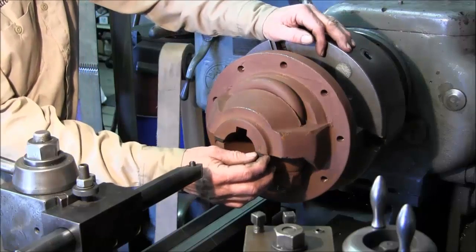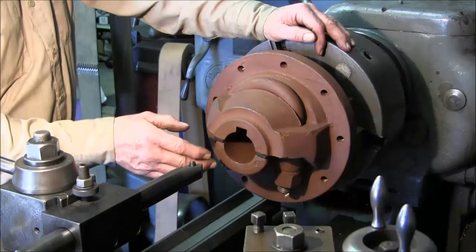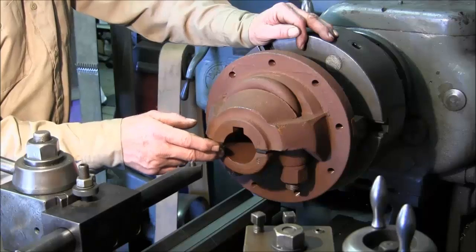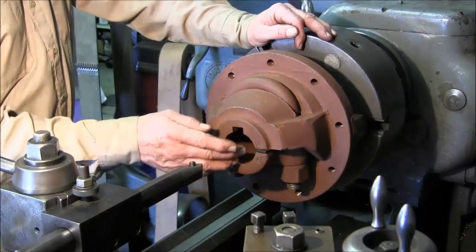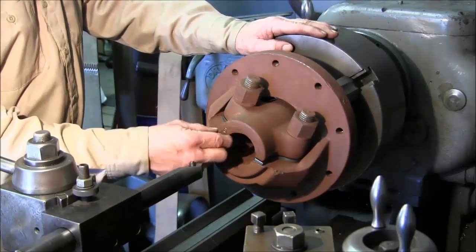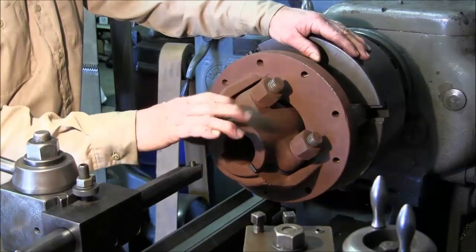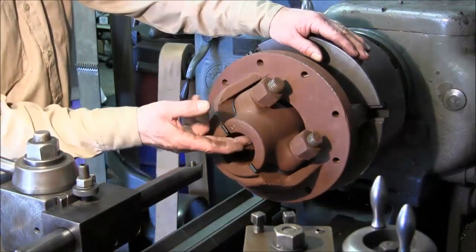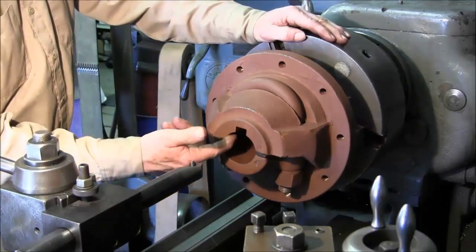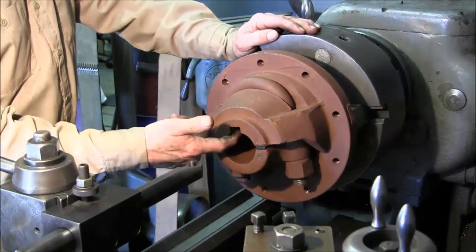We shimmed this at 3/16. It was somewhere between 3/16 and 1/4 inch. That was the total amount of clearance that we put in here, with a piece of 2 1/4 in here. It's a rough casting, and it's kind of hard to decipher, so we went ahead and picked a mean spacer diameter of our own, which is 3/16, which will be well enough space for this thing to clamp tight. So it is going to be hitting the top before it starts cleaning up on this edge. Once we get to this edge right here, it's going to be 1/16.